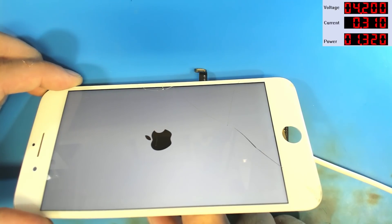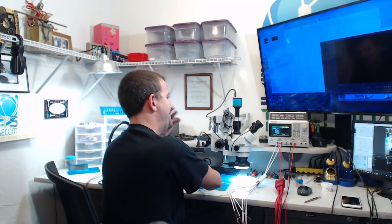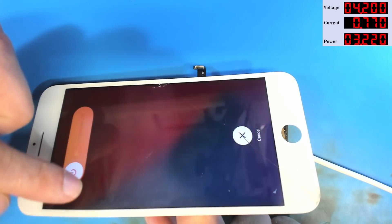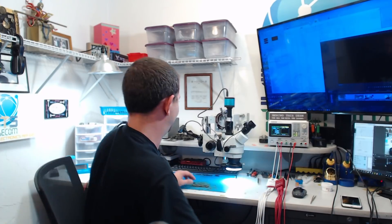70 milliamps. 200. Watch it boot up and run fine. 300 milliamps. The screen just got brighter — this thing is going to boot. There you have it, we have working touch. Now I'm sitting here stuck. I've already ended this video, but I don't actually know how to end this video. I put a whole lot of work into this one, and all I had to do was jumper that little boost IC. Maybe if I tell myself it's going to reboot after three minutes or something catastrophic would have stopped me from getting the data, that'll help me feel better. Probably not.